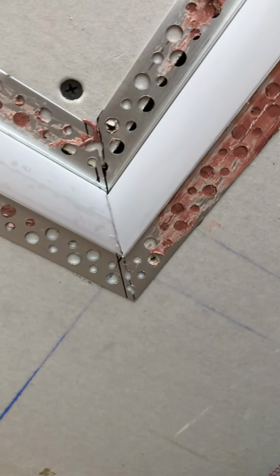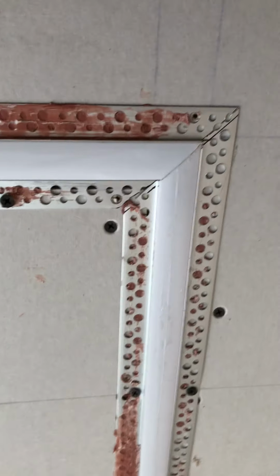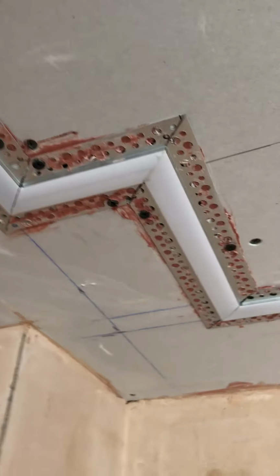The rest of the corners, where we've got a 90 degree mitered joint, we will be either using soldered on ends and then tucking up into the roof space, or we will be making a soldered joint with a very small section of cable, basically to keep the LED strip as constant throughout. We just want to avoid dead spots, we want to avoid gaps in the strip.